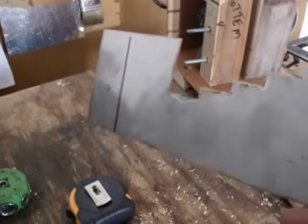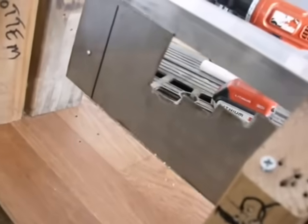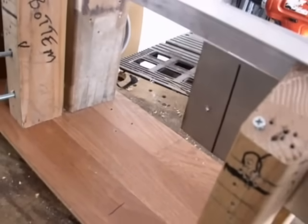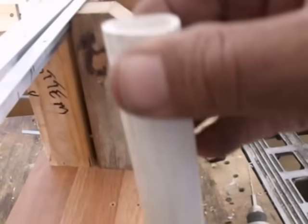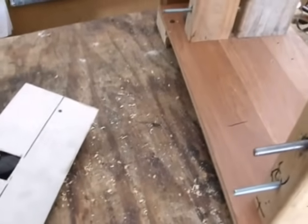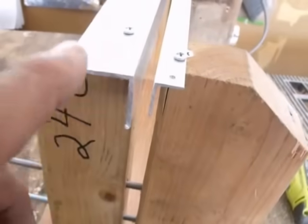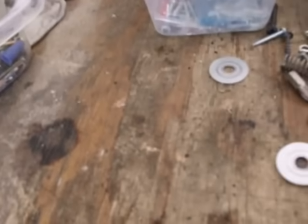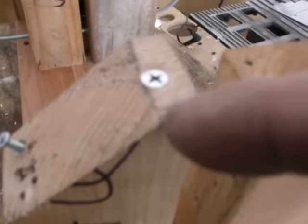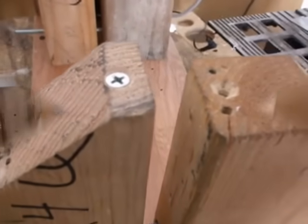The way that works is that you're going to have this little piece of metal in between the boards. When it reaches a certain slot — that's the size it indicated — it will just pop out and shoot down the PVC pipe and go into a little collector bucket on the bottom of your PVC pipe, and it goes straight down into it. The critical part, though, is making sure one side is just a little bit higher than the other side. These little elevation screws — you screw them out, and it comes up; screw it in, it goes down. That way you can adjust your elevation.